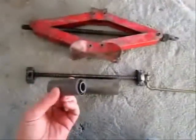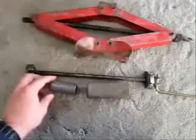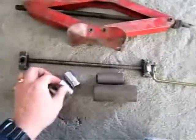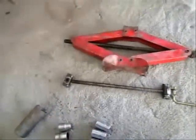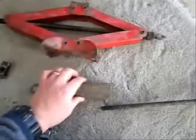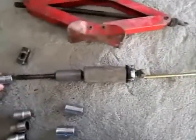There's a new bush which will go on a Series 2A Land Rover, 1966 one. As you can see, that will fit inside. Here's a pipe, because as you're pulling or pushing your bush out, it's going to go somewhere — it's going to be going inside that bit of pipe. And you'll need a selection of sockets, or bits of smaller pipe that will just go in there.